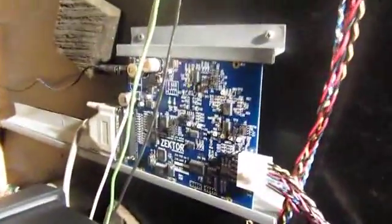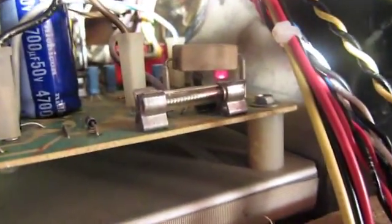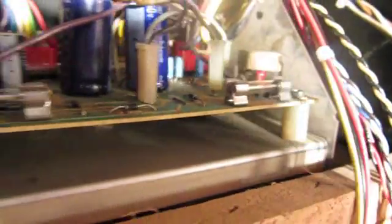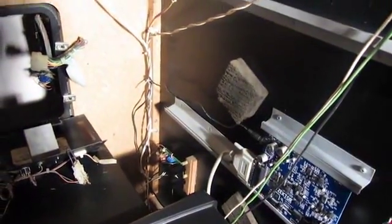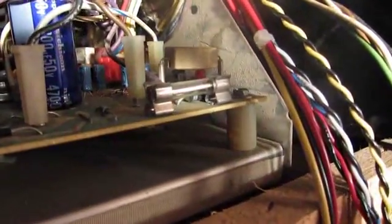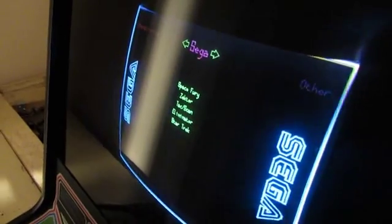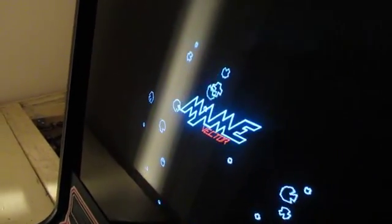Here we go. The vector board has its light on, and here's the spot killer light we were talking about — you can see it down there, which is a good sign. You can hear a slight hum on the monitor and amplifier, which is a sign that's working. There we go — the spot killer light went out and we're hearing the vectors being drawn. You should see the vector main screen up on the screen right now. There you go!